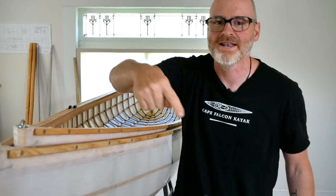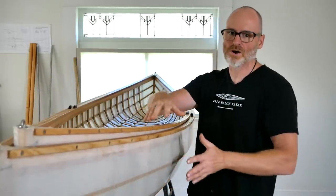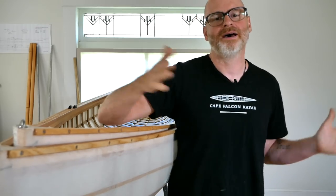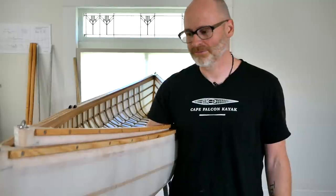There might be an issue with the hull shape at the front — when you're building a hard-chine hull, especially at the bow entry, you have to be uber careful to make sure any hard-chine transitions are kept to just a couple of degrees or less. If the water transitions over a hard chine too abruptly, it creates a nasty vortex, and F1s built with a slightly too big bow rib end up paddling like crap for that reason. With small boats, trial and error is just as important as any ship modeling software because water viscosity at that scale, combined with small wave effects and the asymmetrical thrust of a paddler, throws in so many variables.